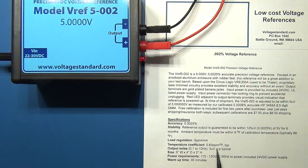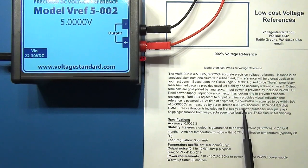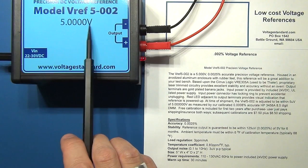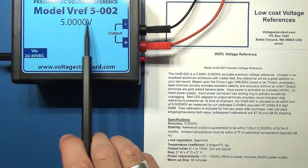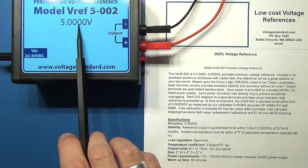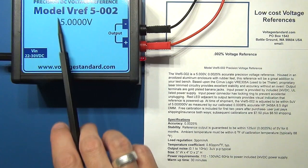The reason for 5 microvolts is that there's potentially some noise coming out of the device in the order of 3 or 4 microvolts. But even if his device is showing almost exactly 5 volts, his accuracy on his HP is 0.0008% or 8 parts per million. That translates realistically to roughly 30 to 45 microvolts — so basically down to the 4th digit. On the device you can see there are 4 digits, but on his 5th and 6th digit you're looking at 45 microvolts that it could be out. So certainly, as noted on his device, 5.0000 volts — you can almost take with certainty that's the reference you're getting.